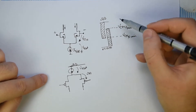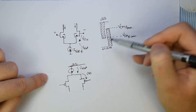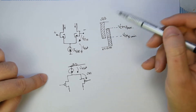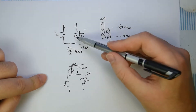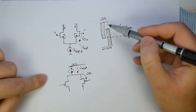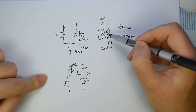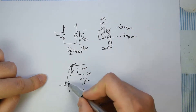As you see, if we use these two blocks together, we can cover the entire range. So we can obtain a full rail-to-rail input stage. But, as you can imagine, having two stages is not that simple. The main problem is that we have an overlap region where we have amplification from both the NMOS input pair and the PMOS input pair simultaneously.